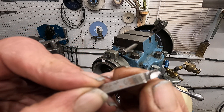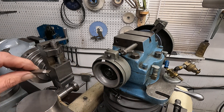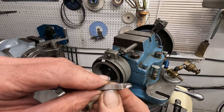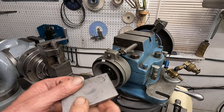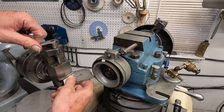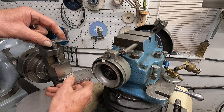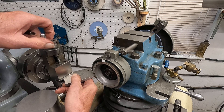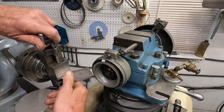I found this beat-up tool - let's see if I can get the edge. It's got a good chip in it. I could set this up carefully in the cutter grinder with the vise and angles and all that, but I'm just going to take care of it by hand. I put this little piece of steel in there, got a bevel so I can tilt and get close to the wheel. I got the head set about two to three and a half degrees so I can set this kind of down and get pretty close to the wheel.